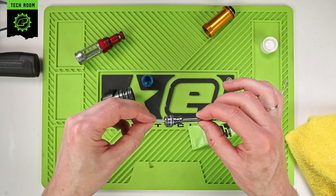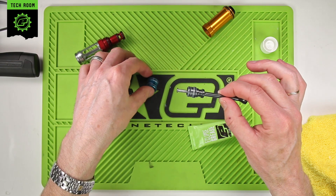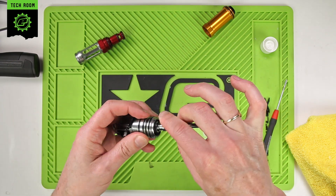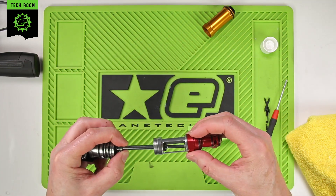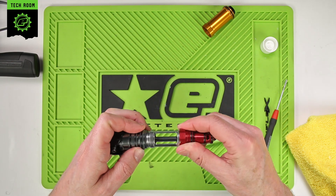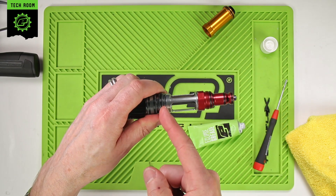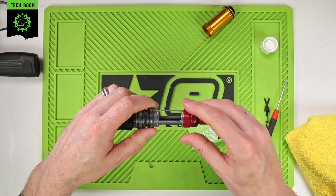Once you've got those two parts greased, put the spring and spring guide back in, slide that inside there, and then the whole assembly can get pushed inside the switch body. Just hold those in place, slide the joiner and bolt guide back on, and screw those until you have metal-to-metal on the joiner switch body.